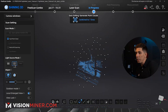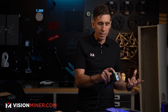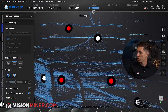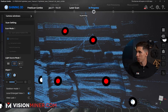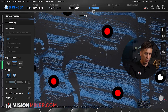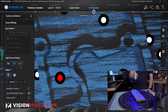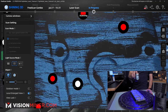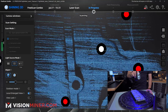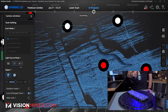I'm going to pause and switch to the seven laser lines. At seven lines you have to be a lot closer to the part, because the seven lines are designed to get extra high detail from each perspective. I'm actually super close to the part — way closer than you would be on most scanners. I'll jostle the lazy Susan a little bit and focus on getting the area with the serial number and those little casting stamps, just rotating slowly to gather all that detail.